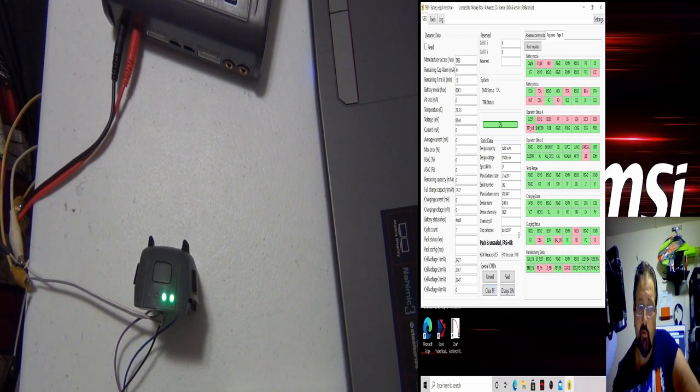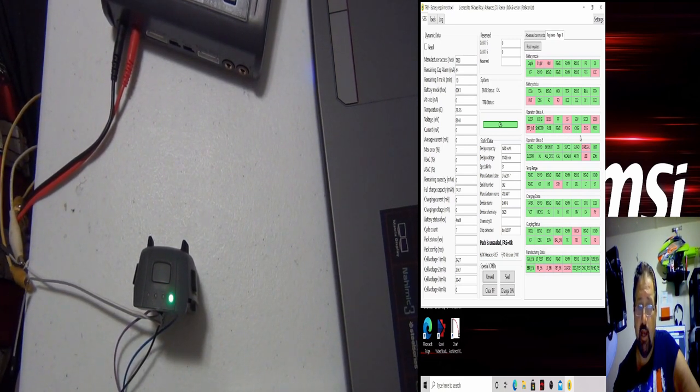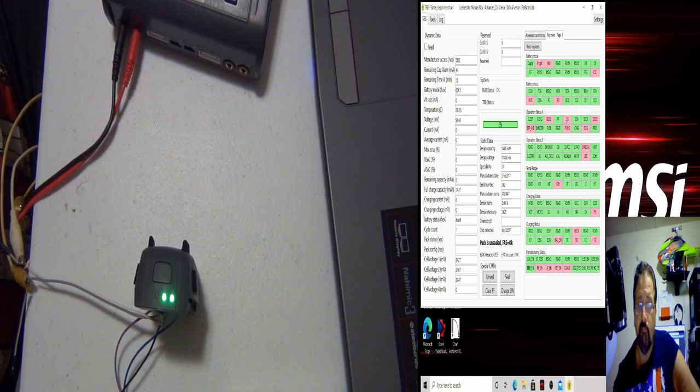The PF is still enabled. Let's clear the permanent fail. Let's do read the register. Okay, permanent fail is gone. The SS is still hanging around. That's a hardware problem. So, we have the precharge. I think it's precharge, charge, and discharge. All right, they're both lit up now. I still have this problem with the SS. So I think it's because we still don't have enough voltage in here. We're not up to 3, so there's still a hardware issue.